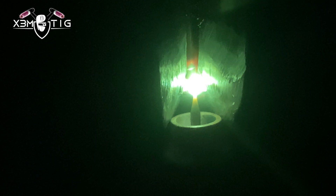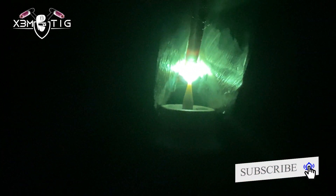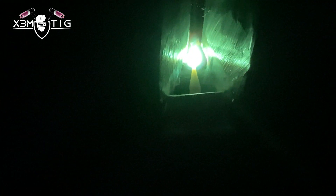Once you've got a good setup, it's pretty much the same as welding carbon. It also depends on the grade of chrome — in this case P22, it's not that bad. If it's P91, that's a little bit trickier and harder to manipulate the rod. But as long as you've got really clean prep and a nice setup, there shouldn't be any issues.